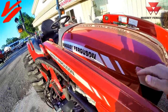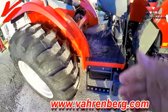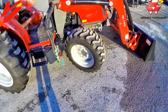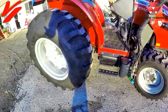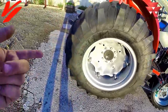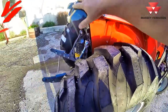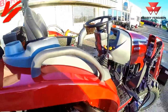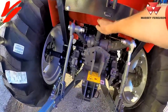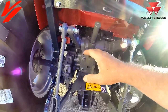That's a heavy-duty hood — you get more for your money with Massey Ferguson. Your fuel primer is right here. The tractor has steps on the left hand side and is fitted with R4 tires: 10-16.5s on the front and wider 17.5-24 rear tires, giving you more flotation. You have metal fenders — heavy-duty heavy metal. Your hydraulic oil fill is right there and handles the hydraulic transmission, rear end, differentials, and the full hydraulic system.